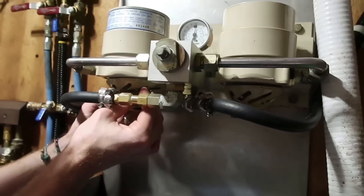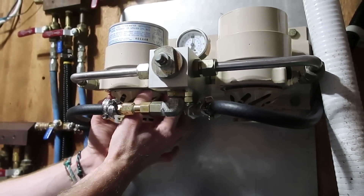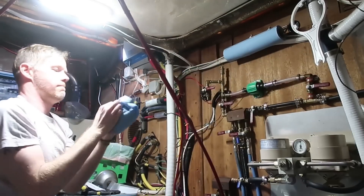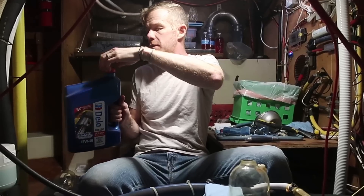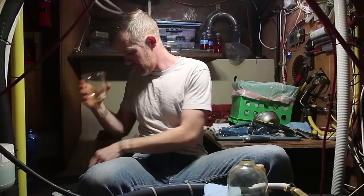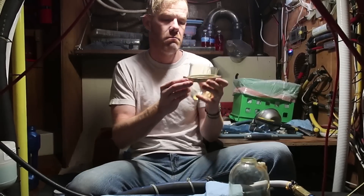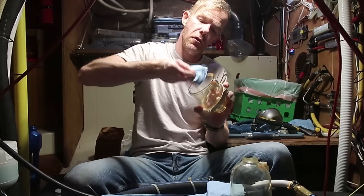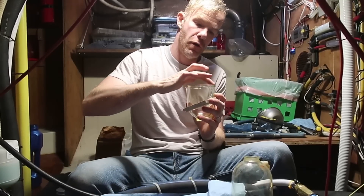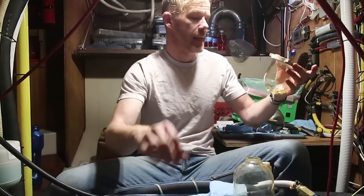I'm going to set this up into place in this groove and see if it will stay long enough for me to get the bottom half on. Now we're going to put the bowl back together — get a little oil in the cap, take the bowl, take the bottom collar, drop the bowl in the collar, wipe the sealing surface on the bowl, then take just a touch of oil, put it around the rim of the bowl where it contacts the O-ring, and install the collar.